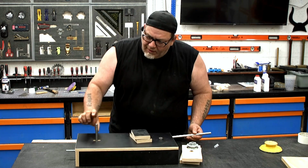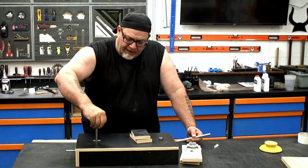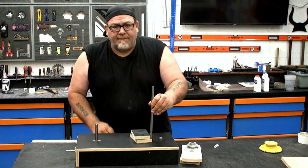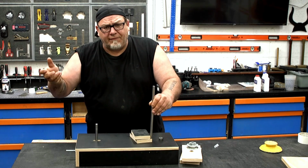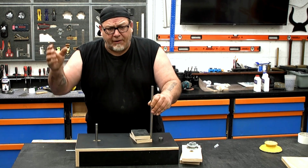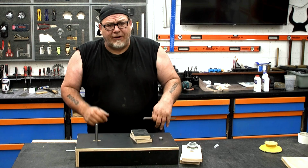Now on this one, we've left it about 4 inches tall, and the drill press will attach here, and the pulley system will turn this, and then we'll be able to control the revolutions per minute because the drill presses are variable speed. Whether you have a dial one or belt system, you can get them really low speeds, which makes it ideal for running a sharpening system.